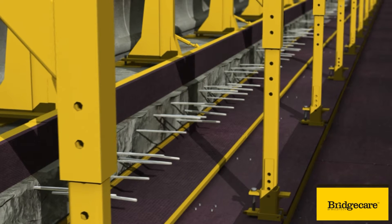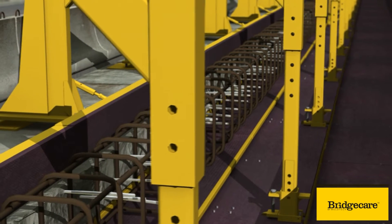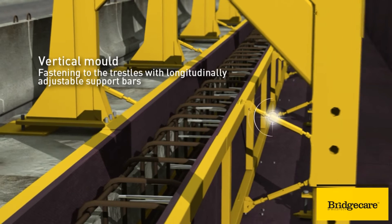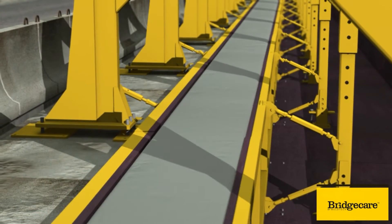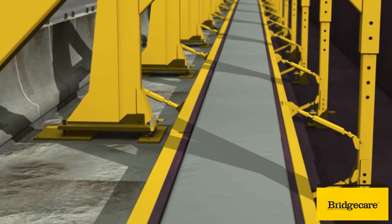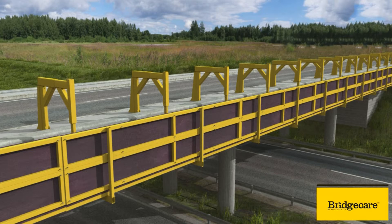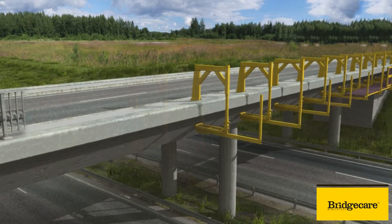After the base mould, the inner vertical mould is positioned, its lower surface placed equally to the level of the upper level of the deck. After this, the edge beam is iron mounted and the outer vertical mould is installed. Now everything is ready for casting. When the concrete is set, the vertical moulds are removed and the demolition platform lowered to allow the base mould to be removed. Now the other parts of the system can be removed in the reverse order of the installation.